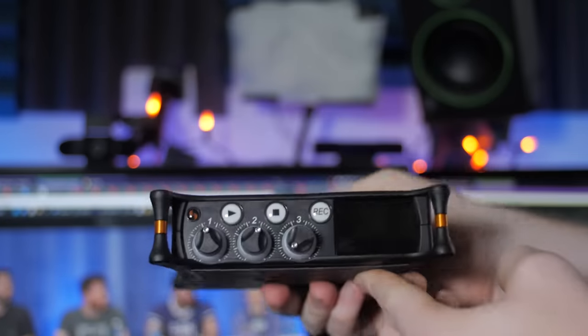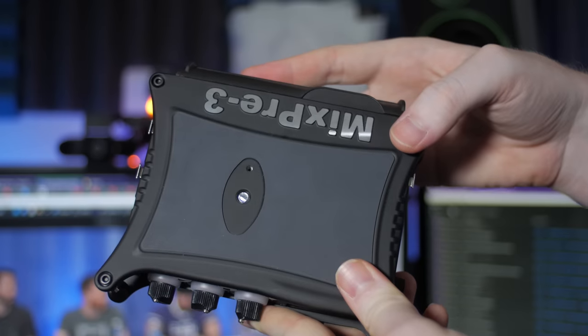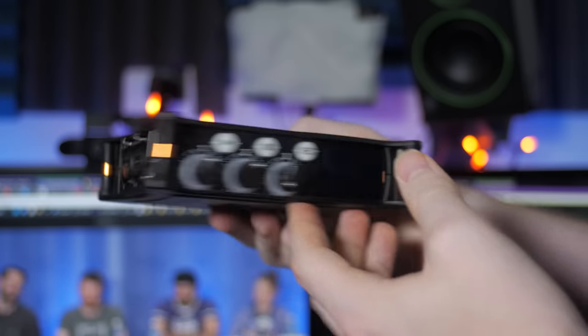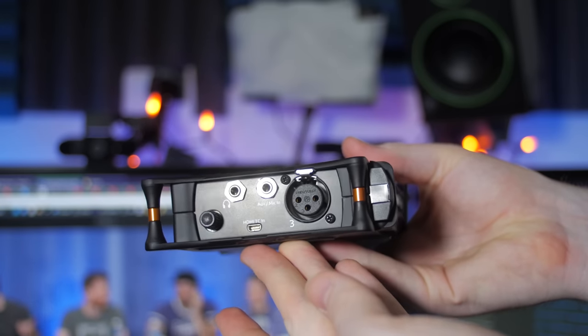There's a huge issue you might run into with the Shure SM7B: it requires a lot of gain. This is a passive dynamic microphone — it doesn't take phantom power, but it requires great preamps, or a combination of your mixer or interface's preamps with an external one like the Cloudlifter CL1 or Triton Fethead. My dedicated Nady preamp just couldn't do the job cleanly enough, but my DBX286S — which also powers the RE20 on its own — seems to handle it just fine. Here's a quick sample with only slightly adjusted settings from what I normally use on the RE20.